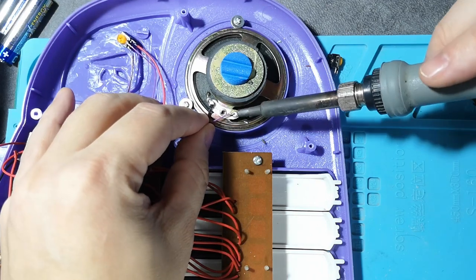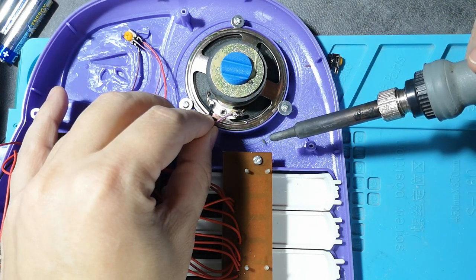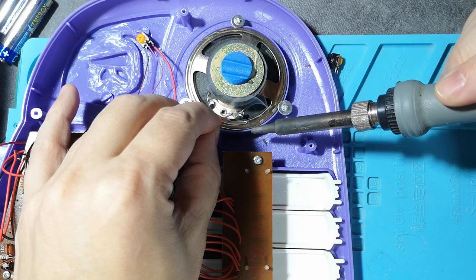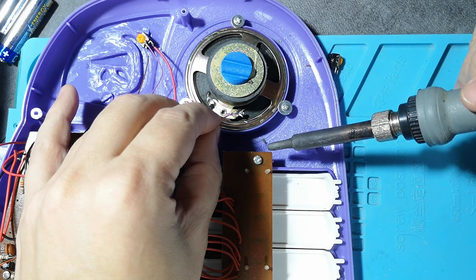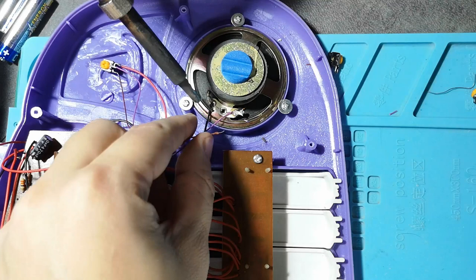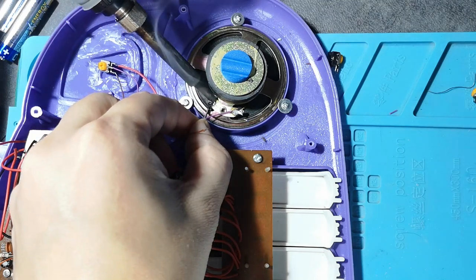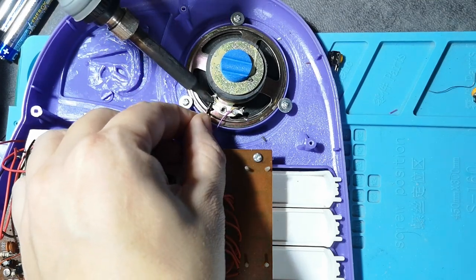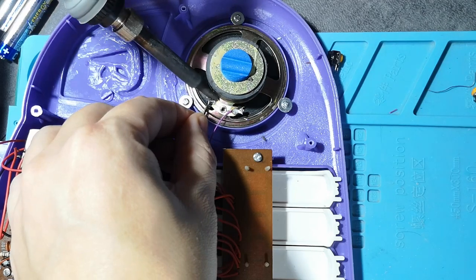The way this is connected: the input from the piano goes to the potentiometer, the middle pin from the potentiometer goes to the positive side of the speaker where the red wire was, and the brown wire I connected for the potentiometer goes directly to the black side of the speaker wire. You keep the black speaker wire where it is and add the extra brown wire — the last pin ground wire from the potentiometer — connecting it to ground, as is needed for a voltage divider.